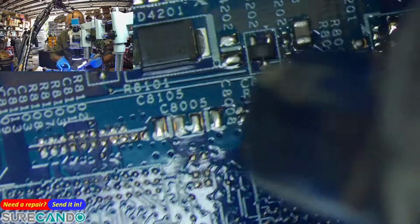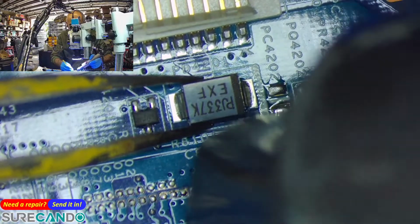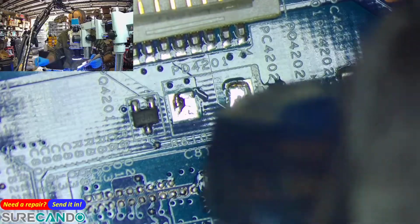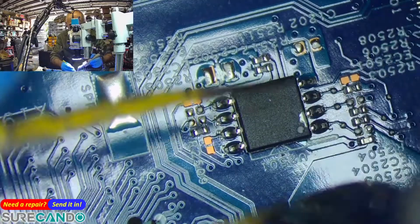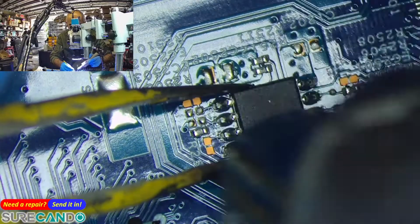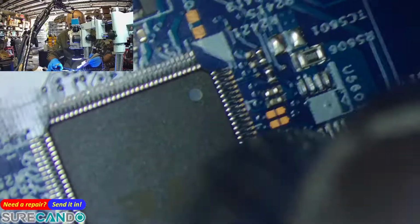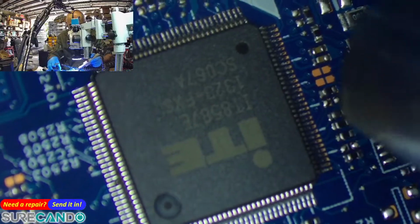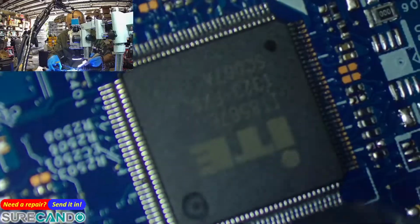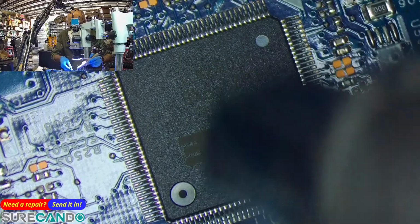So these diodes, they can be useful. Yep, around the battery connector especially. The designs don't change much on them. It's a BIOS chip, probably a 4 megabyte. They don't contain, oh they do contain, yeah they do have a Windows serial number. 85, 78, 85, 87E. Okay, so we can practice programming on these, no problemo.